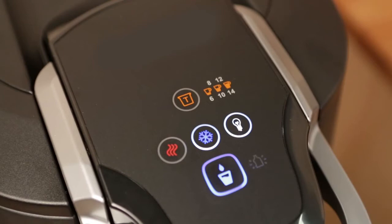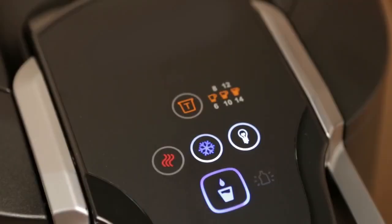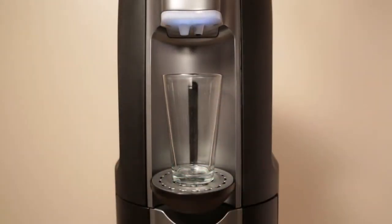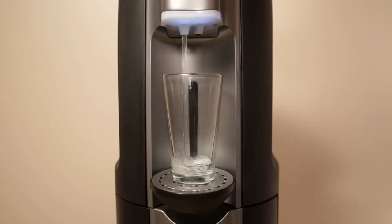Cold water is the default setting, and the button's unlock indicator ring will be blue. If the teacup or hot water button has been pressed first, the indicator ring will be red. The water bottle light indicator flashes if there is a water source problem. Once the water pump stops, place a cup under the nozzle and press the dispense button. Water will dispense from the cold reservoir.